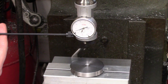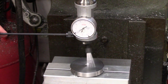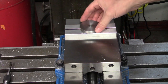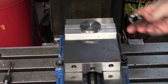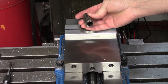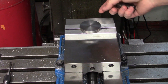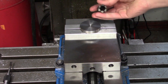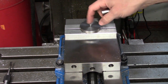Just make sure your machine is in low speed before you turn it on. For more information, check out my video on work locating on the milling machine — I will put a link to it at the end of the video and in the description. This could also be done using a dial test indicator or even just an edge finder. To actually make the cuts, I am using an annular cutter — the type of cutter used in mag drills. They are great for cuts like this, especially compared to a hole saw which wobbles around a lot and doesn't leave a very good finish. You could also use an end mill, but this is a big cutout: the cutter is one inch or 25mm in diameter and plunging with large end mills is not my favorite thing.